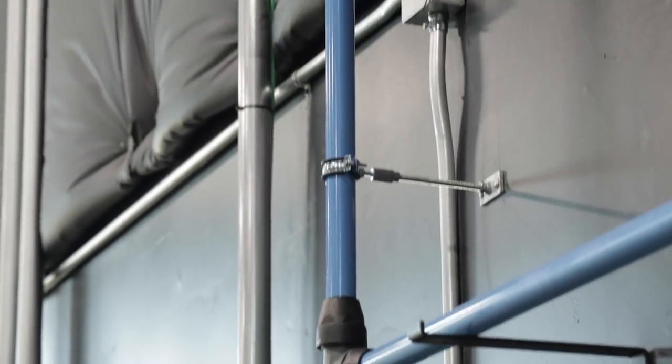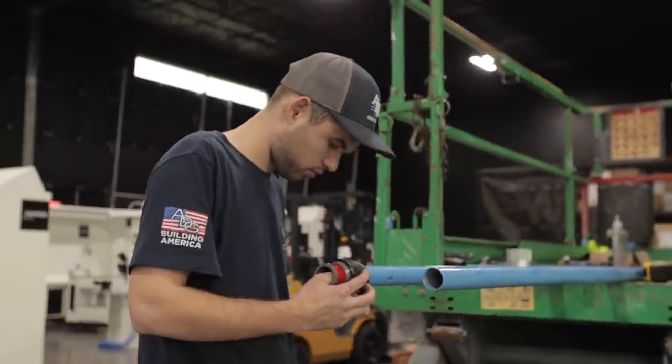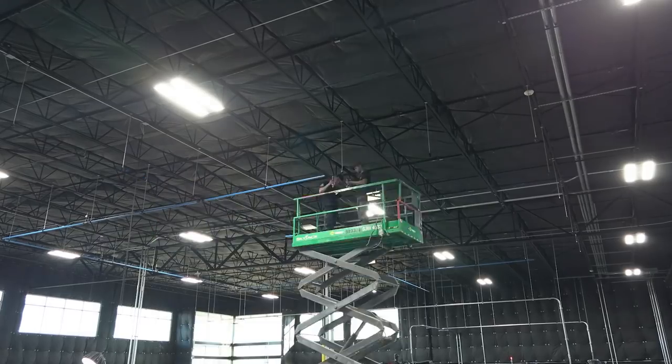We're coming out of the compressor through the filtration and up the wall. We're using an inch and a half extruded aluminum system, going up the wall and coming over to the main production area where all the machines are located. We're using three-eighths threaded rod for hangers — we prefer these over wire hangers. We use a solid three-eighths rod with a clip-on hanger that holds the pipe. If anything ever hits it or the pipe comes undone, wire hangers would just blow out like spaghetti, so we really want to secure the pipe.